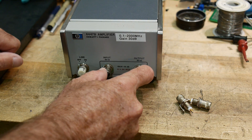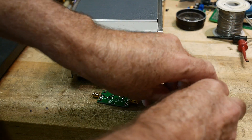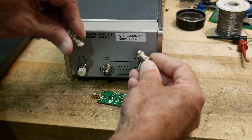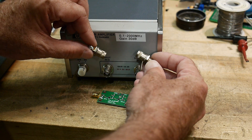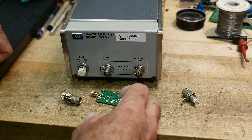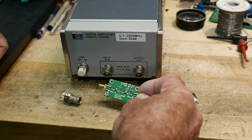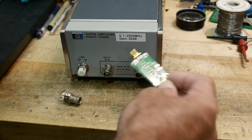I'm going to put both of those amplifiers in here, so I'll have one section that's a 30 dB gain and one section that's a 60 dB gain. I'm going to put two more BNC connectors on the front and have two sections. You could daisy chain them together and have 90 dB of gain — it'd probably oscillate like crazy, but maybe it'd work good.